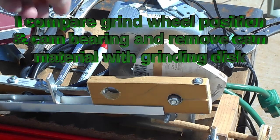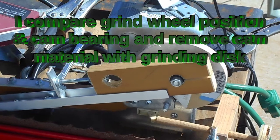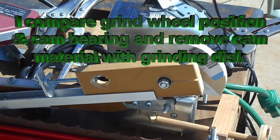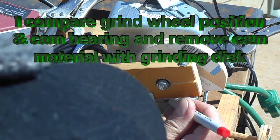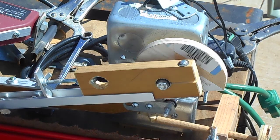What I do is I use a red Sharpie. I will get down here so I can see my wheel and see when it touches and when it doesn't, and how far away it is. If I need to take more material off — which I know I do right about here because my wheel gets a little too high — I will take the red Sharpie and put it where the wheel contacts the cam. It is not always on the top; sometimes it's on the side or way down the side. So be cautious of that.